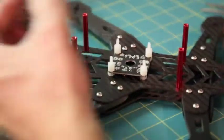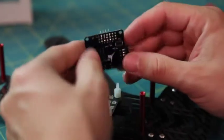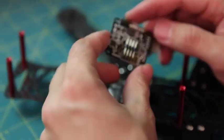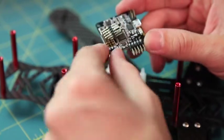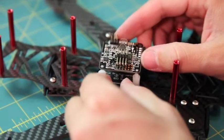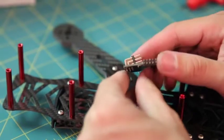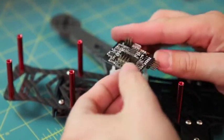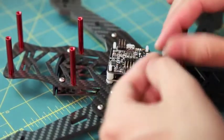With the Ninja 32, you'll want to do a bottom mount for the transmit and receive connections. The critical part when soldering this board is the motor pins — they need to be inward or straight up. The reason is clearance for your six-inch propellers: if they're sticking out the side, that big wire harness with your servo leads will get hit by the propeller. Make sure to use straight pins or angle them inward. You can then clock your board — I normally clock mine 90 degrees counterclockwise — then place it down and use nylon nuts to secure it.